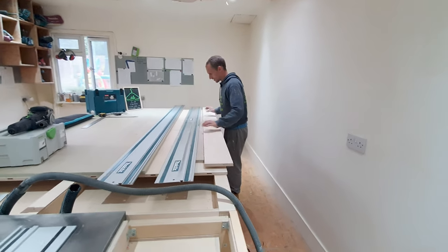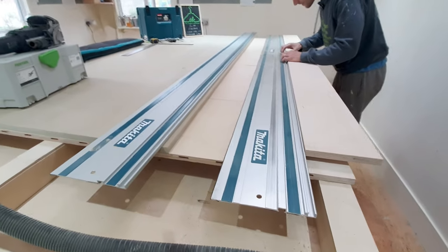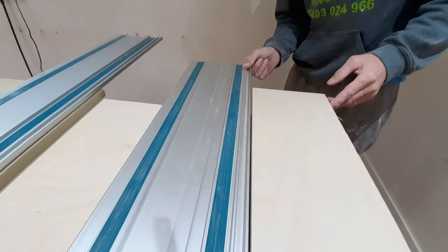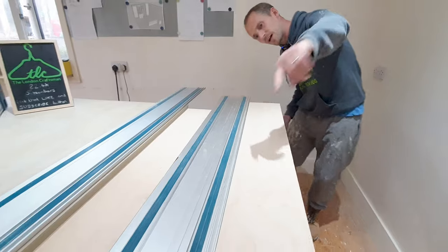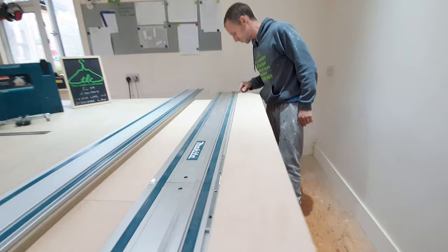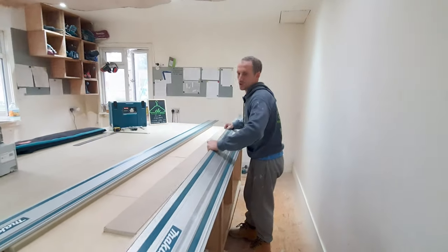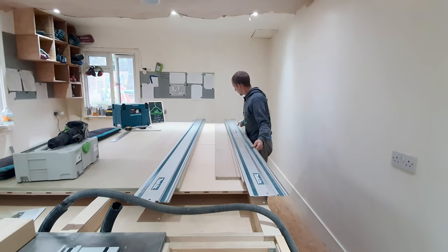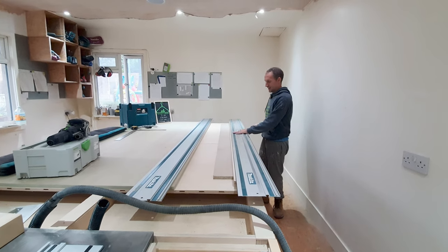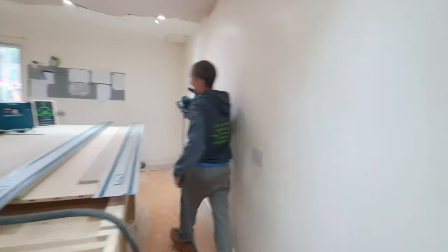I want to put that up against our reference cut to see how straight it is without forcing it. I can see it going off a little bit there - yeah, that's no good. It's following the line nicely here where it's tight against my cut, but from the second track onwards there's about a three mil gap. So let's go ahead and cut with this jointed version and double check, because we can use that reference cut as a straight edge. You can also see there's no joint on the reference, so if you've got lumps and bumps where tracks are joined up improperly, your saw may want to stop or jar as it runs over.